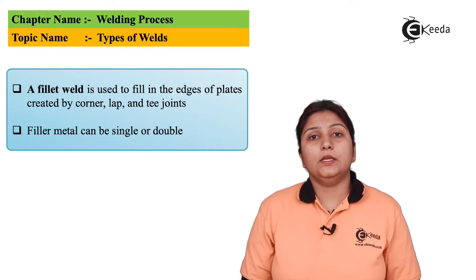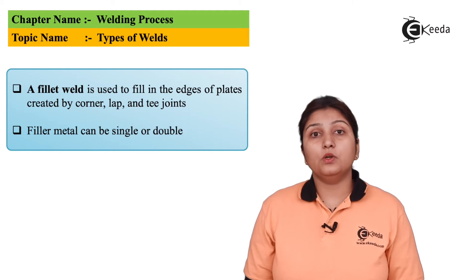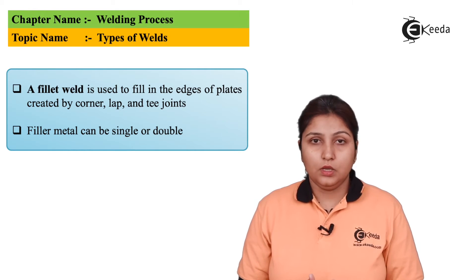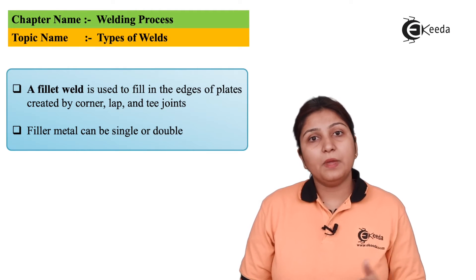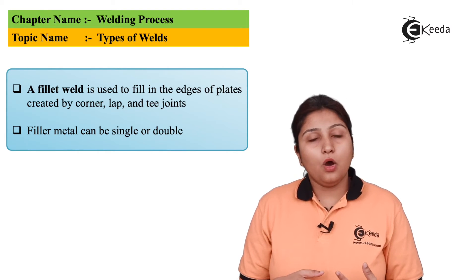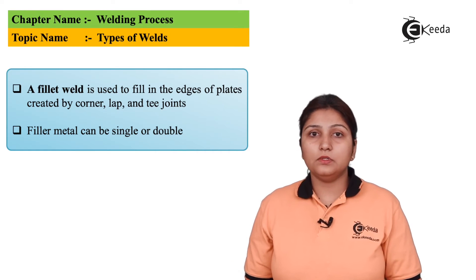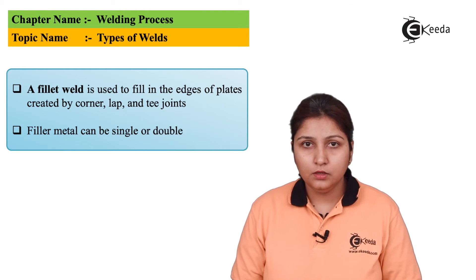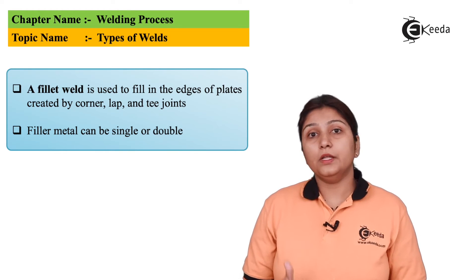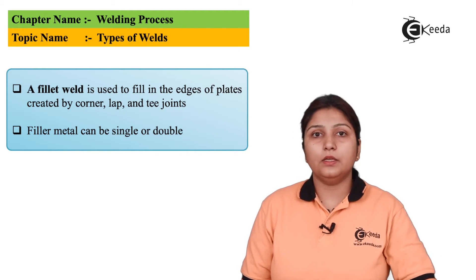The first type of welding is fillet welding. The name itself suggests you just need to fill the corners. If you are talking about a T-shaped joint or an angle-shaped joint, fillet welding is used. For this welding you can use either an arc, or oxy-fuel — anything can be done. Two parts have to be brought together and welding is done at the edges or corners.